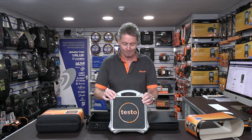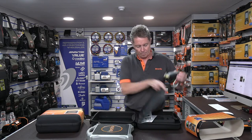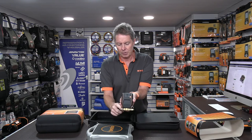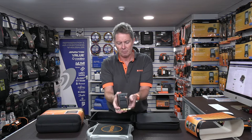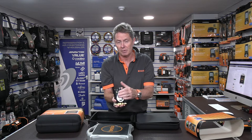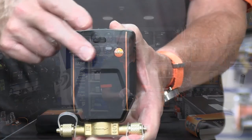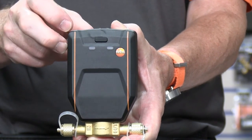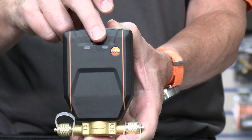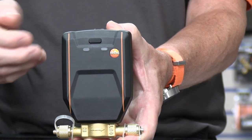Now let's look at the valve in a little bit more detail. Very much like the Testo manifolds, it has a strong sturdy hanging hook. You've got two connections — one from your cylinder and one off to your system. It's battery powered and uses Bluetooth communication for controlling. It's very simple to operate: you power it on and off via the button at the top. There's also a purge function — three rapid presses on the button will lift the valve for one second, allowing you to purge the air out of your system lines as many times as needed.